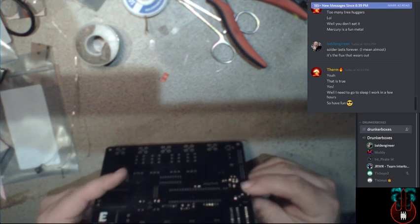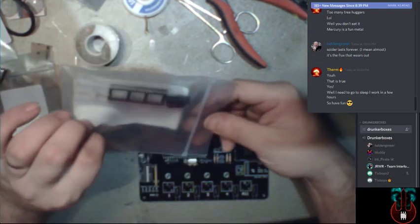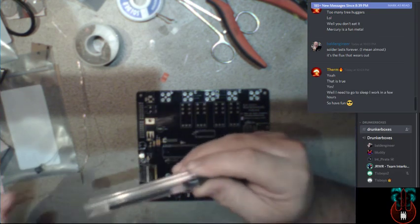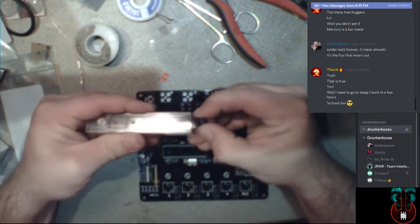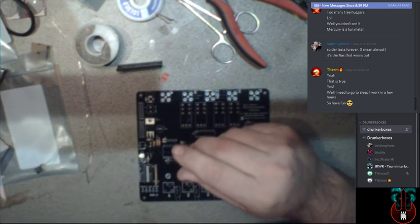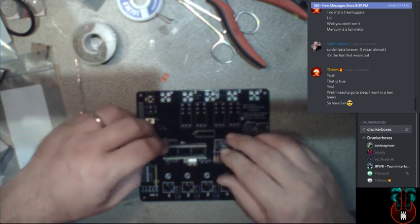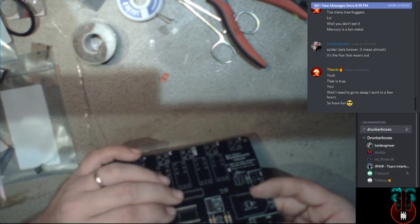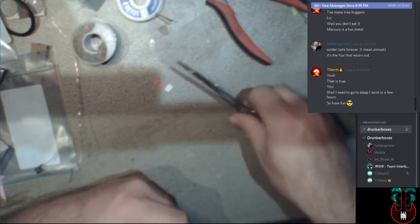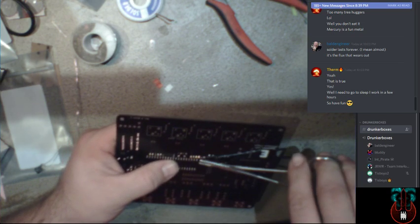We OR the values with the existing value of the register to avoid changing the interrupts used by the Arduino core functions. There's only one other change. We set PWM1A to 1 in register TCCR1 to enable the OCR1A PWM and timer counter 1. The 2 interrupt service routines are really simple, just a line each. They simply set or clear the output we're using, PB3. We first set the output. I did tests on it. It does 0 to 255 very smoothly.